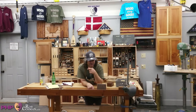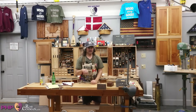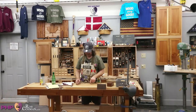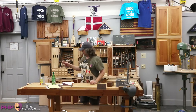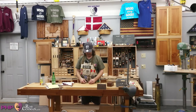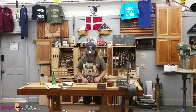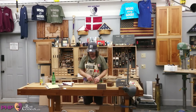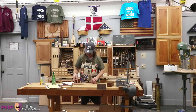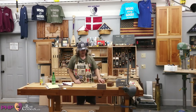Well, you could. If you get a really nice, smooth-cutting, finish-cutting jigsaw blade, what you can do is create some kind of a compass. I think they actually have that on the little foot of your jigsaw. Fasten a piece of wood, and then you put a screw right here in the middle of your 13-inch diameter, and that's holding on to your jigsaw, and you're just going around to give you a perfect circle.